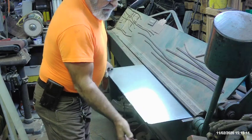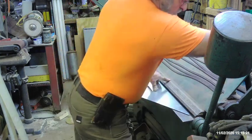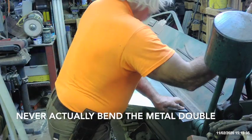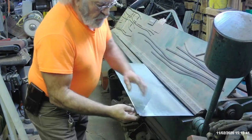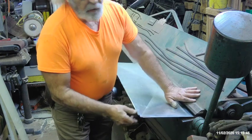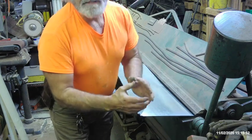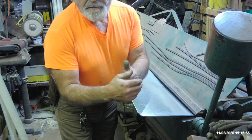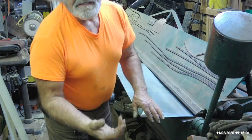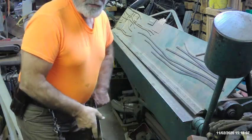There is something you can do to streamline things: you notice I've got two sheets here — you can cross-break two sheets at a time. However, I never recommend folding two sheets at a time. I've worked with guys in the past who would go ahead and fold the quarters and the 90s, and what happens is you end up with two different-size halves. The outside piece, because of slippage and because it's folding around the inside piece, will actually end up about three thicknesses of metal wider than the other piece. So I limit it to just cross-breaking two at a time.